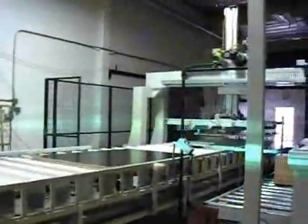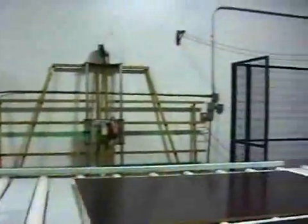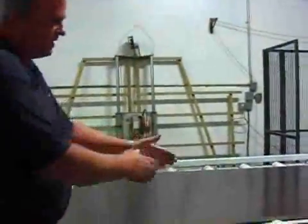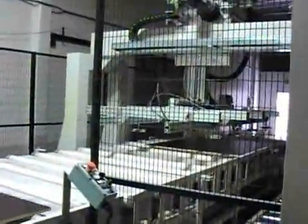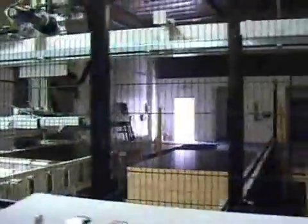And we get up here to the inspection station. There's a full area for the automation at the end. So when the panels come out, you'll see the panels move to the side and align with the rail, and then they hit the stop. That's how this particular machine aligns the material on the pallet. Once we reach the height requirement for the pallet, the signal gets sent to the computer and the unit will automatically move out and prepare for a new unit.